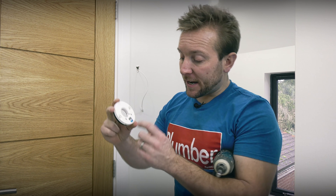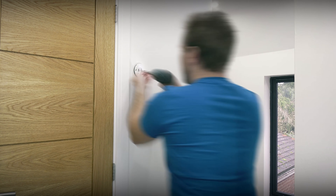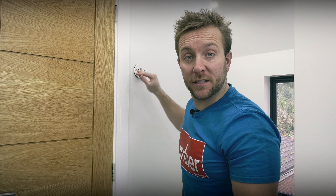We're fitting the Nest thermostat upstairs — this will control the radiators and the hot water. Install it at eye height. Pop it on and, as you can see, it comes alive straight away. Welcome to Nest land! When placing a Nest thermostat near radiators, the room where it's located needs to have a radiator with the TRV left completely open, or ideally remove the TRV head and fit a decorative head. That way the Nest gets an accurate reading of the maximum output of the heating system; the other rooms can have TRVs that open and close freely.